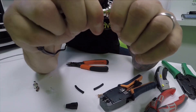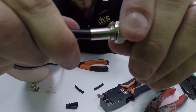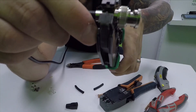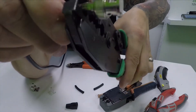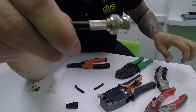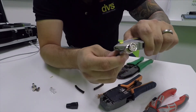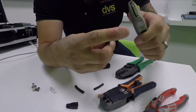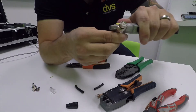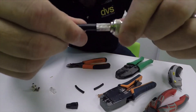All the way over there, nice up to the top — you can see there is still some braid left, we'll get rid of that now. Sometimes you can get rid of it first time, no problem. Crimp at the top, crimp at the bottom, nice and secure. Then you can either get your Stanley knife and run it around there to get rid of the braid, or you can use your cutters. I've got my Stanley knife open so I'll just do that — just be careful with your fingers. There we go — that's nice and cleaned up, no braid. That's what you want to see.